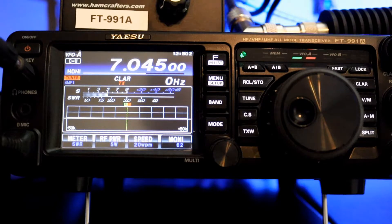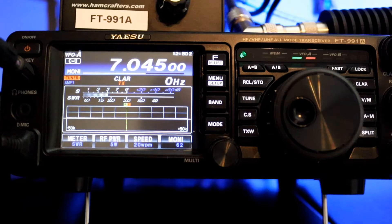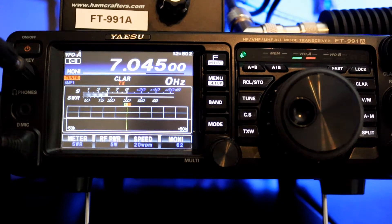A lot of times when you're working DX, the DX station will go to split operations — that's where he is transmitting on one frequency and listening on another. By the way, all of these clarifier settings are applicable to all modes, so it doesn't matter what mode you are in. I simply used CW because it gives the best over-the-air tone and is easiest to hear. The other station is working split, and usually he'll be up maybe five, sometimes two kilohertz. You can go all the way up to 9,995 hertz.